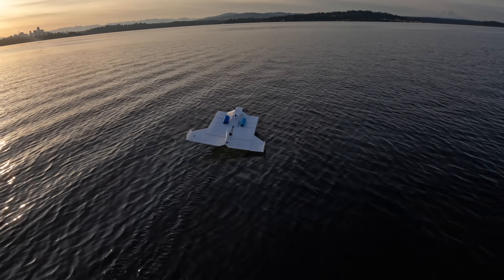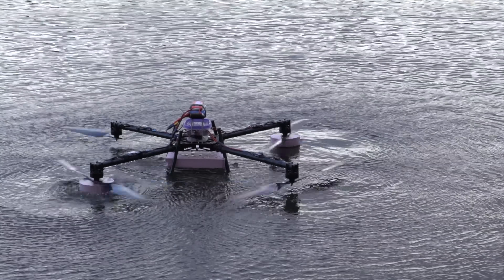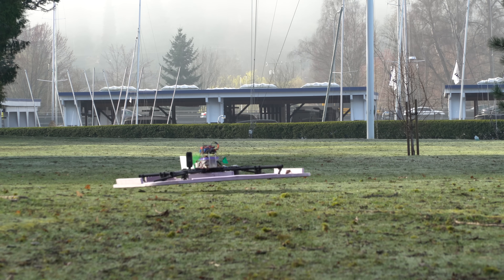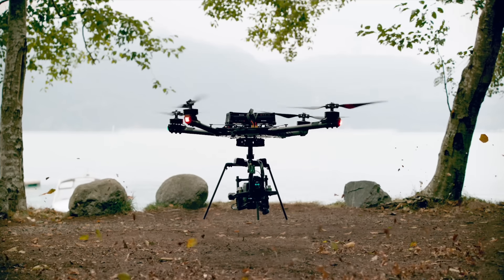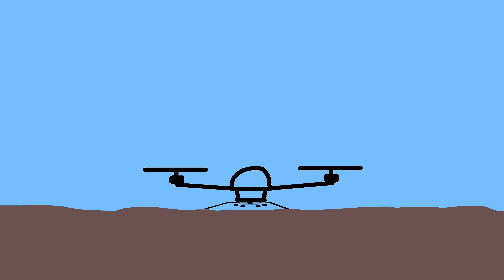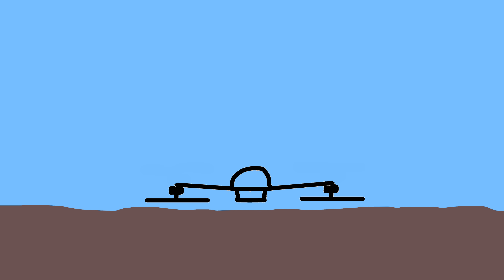In this video, I'm going all the way to the other side of the spectrum and try to get a pure quadcopter to harness the ground effect in a practical way. The first thing we need is obviously a quadcopter. The problem is that the rotors aren't usually that close to the ground — this is lost opportunity for a stronger ground effect, since moving the rotors even lower increases the aircraft's efficiency in hover. My quadcopter is going to be optimized for the ground effect, so there's going to be no landing gear and I'm going to put the motors on the underside of the arms, so the props are as close to the ground as possible.